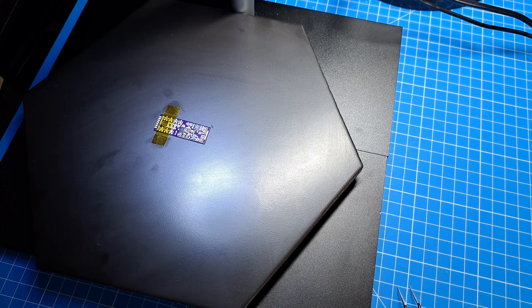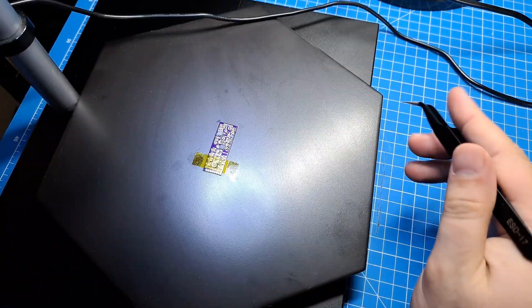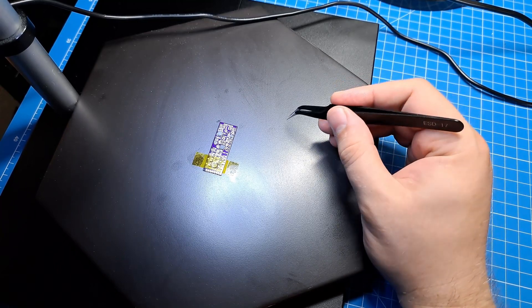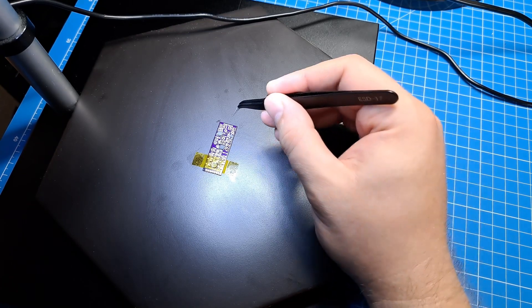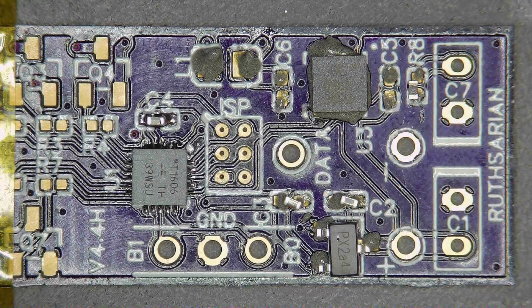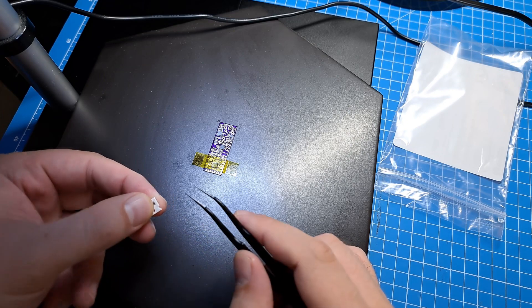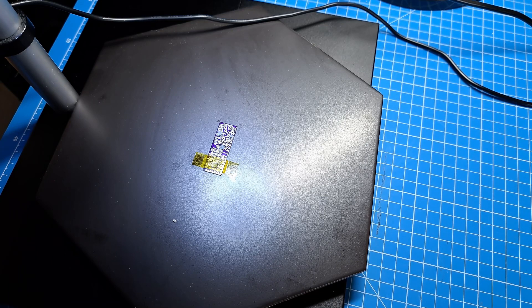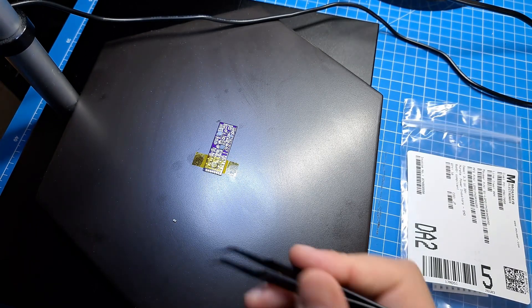10 kilohm resistor — I only need one. I'm going to rotate the PCB 90 degrees, it's just going to make applying these next few components easier. Next I have a 3.3 microhenry inductor. This inductor along with C7 provides something of a low-pass filter, where basically it means that a bunch of high frequency noise that gets generated by turning the LEDs and the blade on and off very quickly gets blocked by these two things.